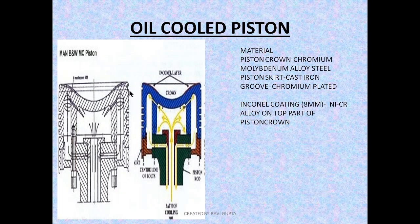One more point — how the piston rod is connected. The piston rod is made up of hollow forged steel consisting of three tubes: the outer tube, the second tube, and the third tube. These three tubes are installed in the piston to provide the path for oil flow. This is how the oil-cooled piston works.